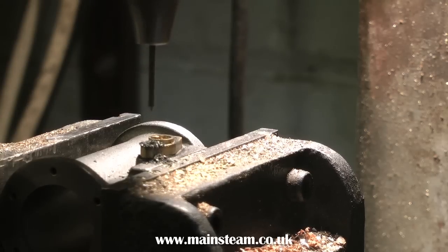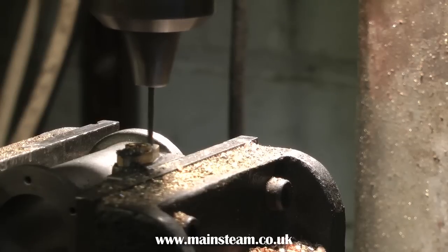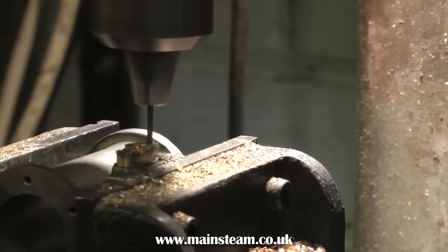As before, this will make sure that all the studs protrude just the right amount. It looks very bad on a steam engine when all the studs are at different lengths, and it's great to have them at the right length without having to cut them. So think ahead when you do this — set the depth stop and get all the holes the right depth.